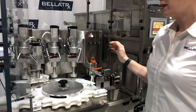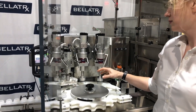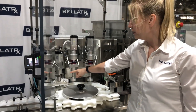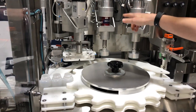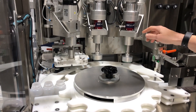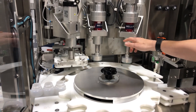Equipped with a star wheel with a slight chamfer on it for a gentle transfer. Three full servo stations. The first station is responsible for floating the capper. The last few stations are equipped with a strain gauge, so very accurate torque reading. We're actually taking into consideration the output torsion shaft when we take a reading.